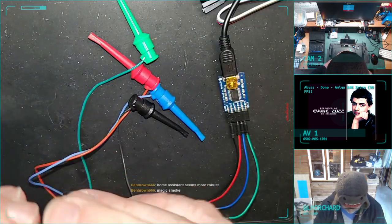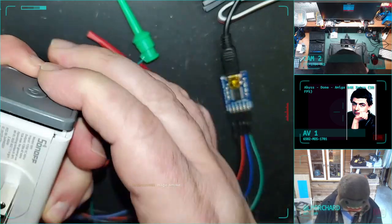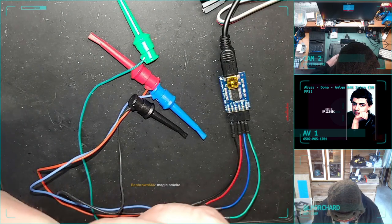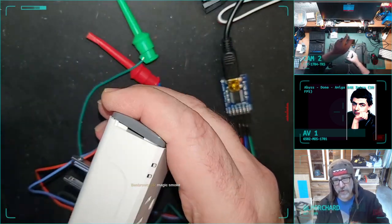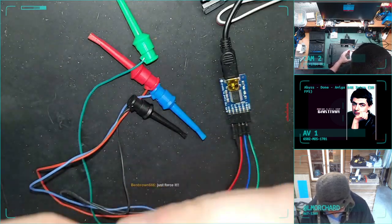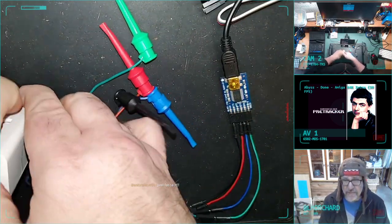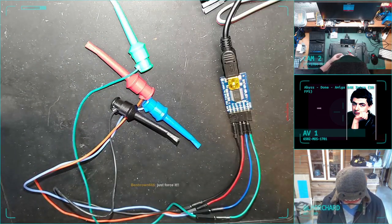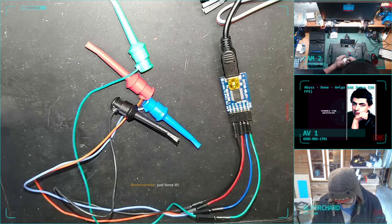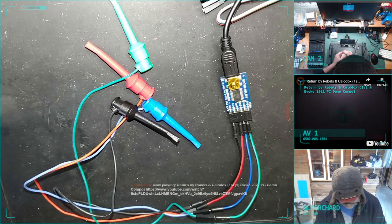But yeah, Home Assistant has been pretty good so far. It's got some obscure bits to it, but it's been great. This is giving me trouble. Why isn't this going on? It's a little annoying because it's programming devices through YAML, but it also works because there's another firmware you can put on some ESP devices. There's another firmware called ESP Home, and it has worked all right for me for some homebrew circuits, but for some reason Tasmota works best for these Sonoff devices I've found.